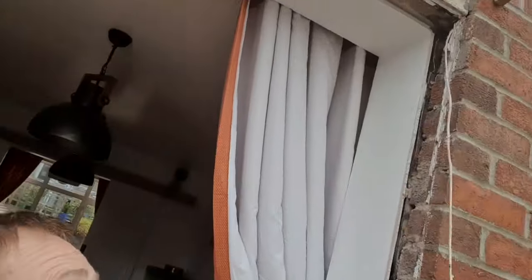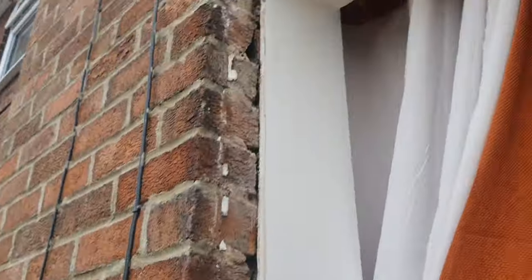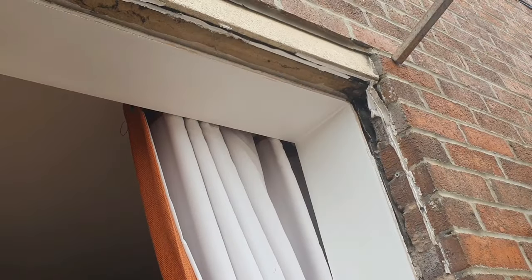Now that window's out, it's time to clear all the sides. Check there are no wires running round. There's mastic up there on these edges — clean all this mastic up all the way around, up on the top as well, all the way around this sill. Then I'll go and cut a sill to the frame, screw it in, get it in place, and then fix it to the sides. Job's a good one.